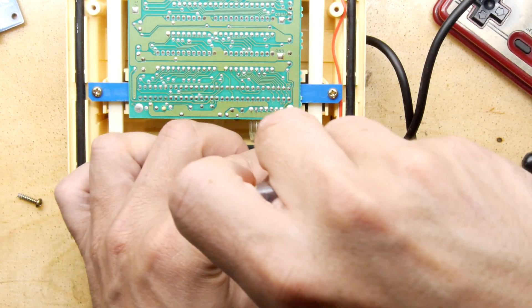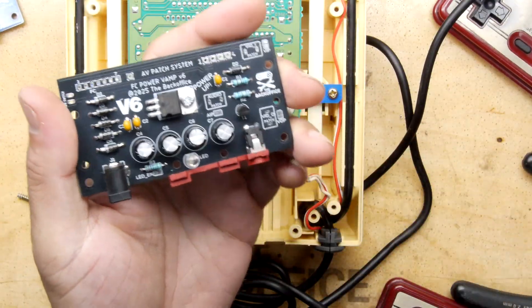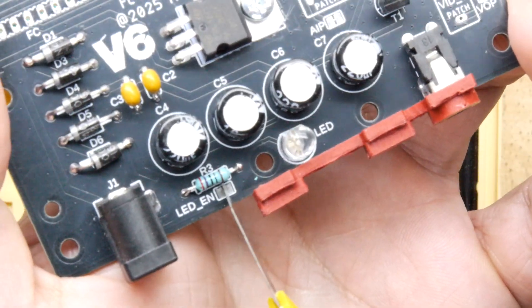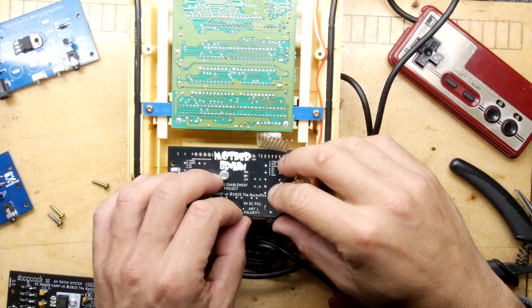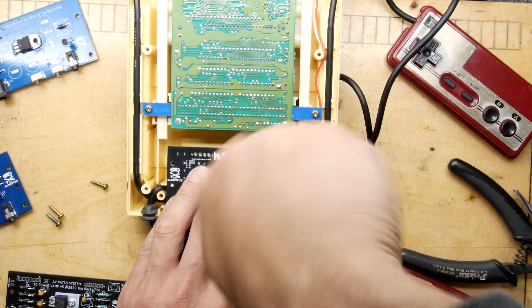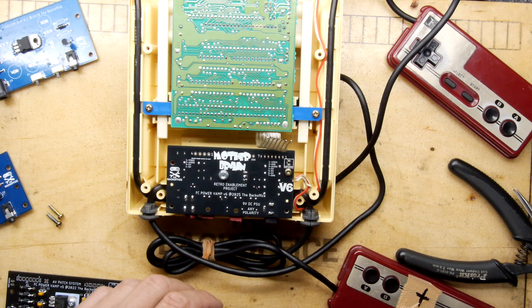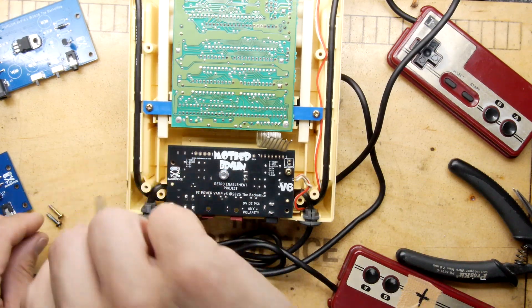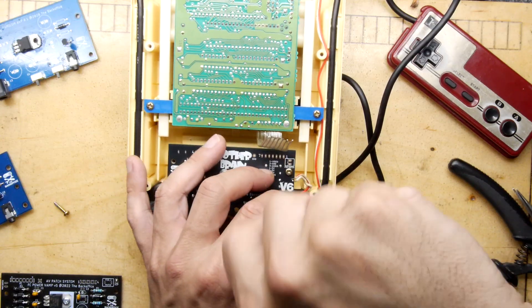Before you fit it in, if you don't want the multi-color LED flashing, you can swap the LED out, but there's also a solder jumper called 'enabled' — you can just see a fine trace in there — just cut it with your knife. It's a solder trace enabling it by default, so if you don't want it, just give it a little cut; you don't even need a soldering iron. I'd love to see if anybody's replaced it with a themed color — like a blue LED on a blue Famiclone would be really neat.